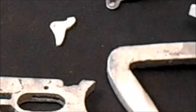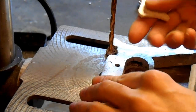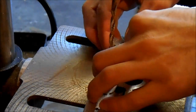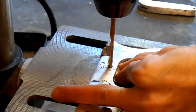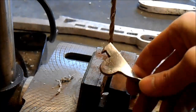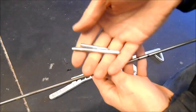We also have to drill the hole through the trigger for it to pivot. And there's a hole down by where the stock is going to mount that we also have to drill — I won't show that, but I'll show you after. Line that cross up with the hole in the casting, then drill through to clean out the hole in the aluminum casting and make the hole in the trigger. We also have to drill through this latch, which is kind of hard because it's steel. And you can see down at the bottom of the handle I've done those holes too.